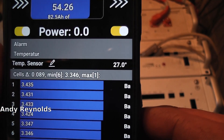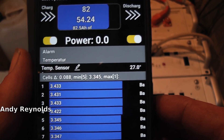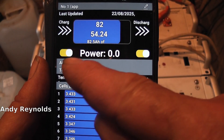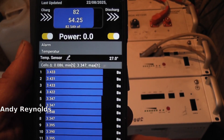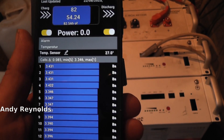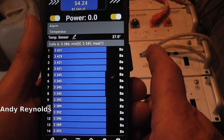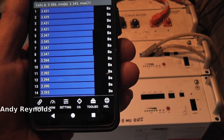The variation between cells seems to be quite a lot at the moment - that's 0.09 volts difference. I have seen it as 0.004 volts, so four millivolts. And if you notice here we've got charging on and discharging - well, I had a problem with this: it would charge but not discharge, this wouldn't illuminate and you couldn't do anything.